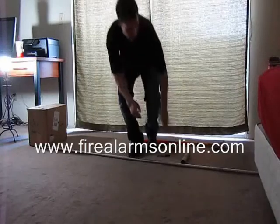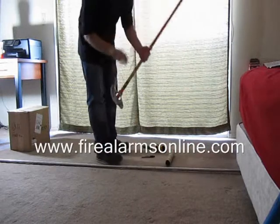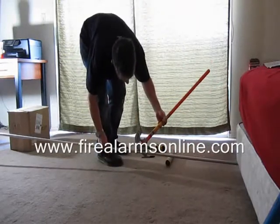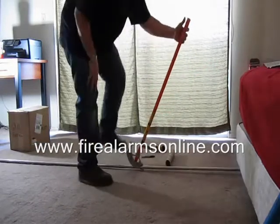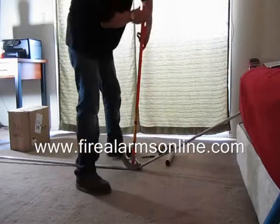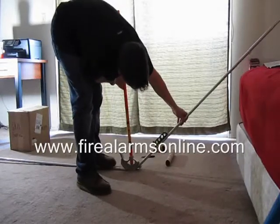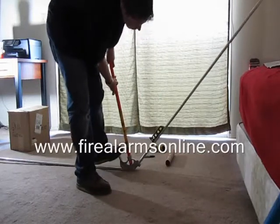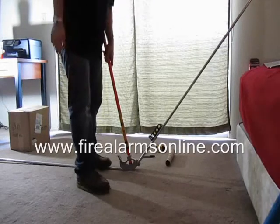Let's give it a shot. Coming from the center point, remember to use the notch. We'll bend this up 45 degrees. It's important to get this one right because this is the hump to get over everything, so make sure that's right at 45.